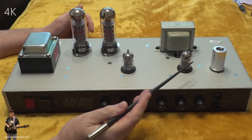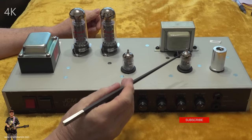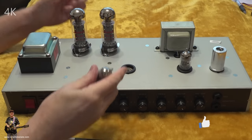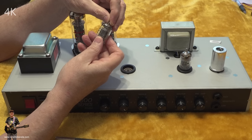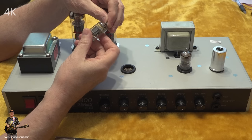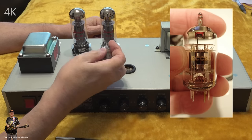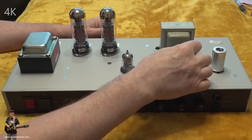We've got three preamp tubes, one Pi tube and two that do the normal work, shall we say. Probably them two, and this one does the balancing. Well, what are they? It's a great question, let's have a look. You'll probably see a picture up there now. It just says Marshall ECC 83 valve, 00449, I think it said, 1219. So there's no brand on them, I'm afraid. I've got a pretty good guess whose they are. That's the first one, and the second one's identical.